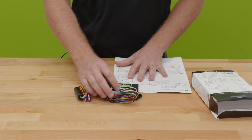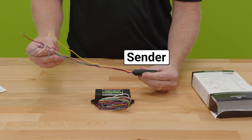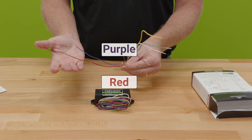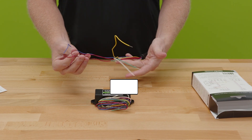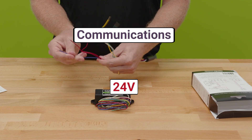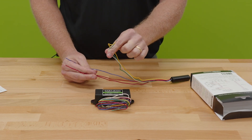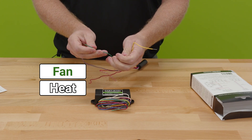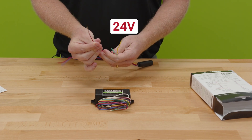Let's take a look and identify some of the conductors. This is what the Model 3000 calls the sender. Your sender wires are going to be your purple and red. You're going to notice that you have two reds — it doesn't matter which one you use, because in both cases red is just 24-volt constant power and purple is really the communications wire. So you're going to use those two conductors to send and receive, and then these become your actual system connection wires: white for your heat, green for your fan, yellow for your cooling, and your other red for your constant 24-volt hot.